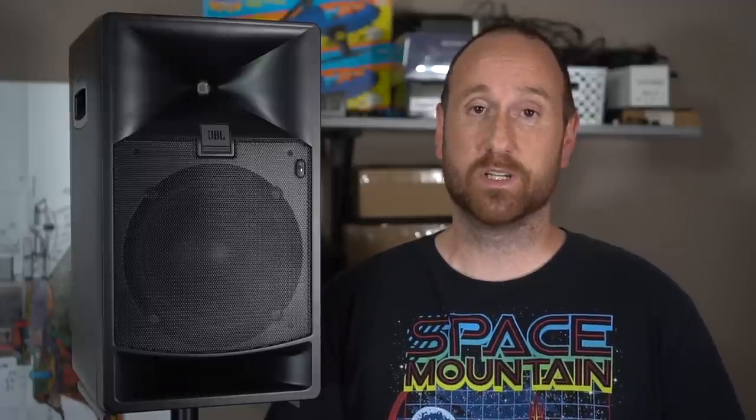That does it for my objective review — all this information is on the website. To wrap up: if you're considering buying the JBL 708p and it's in your budget, I would have no qualms recommending it. My personal taste would lead me to take a very wide Q filter, put it at about 6 kHz, and knock it down just half a dB — just take a little of the top end off. But you're really talking about picking nits. Overall this is a superb speaker: the data tells a great story, output is exceptional with extremely low distortion and a lot of dynamic range for one to three meters of listening distance.